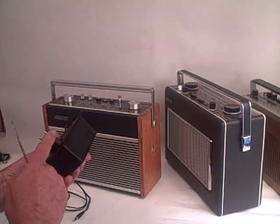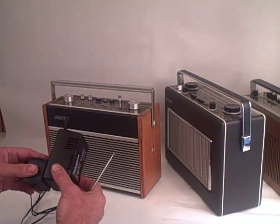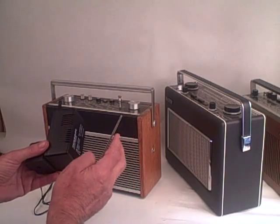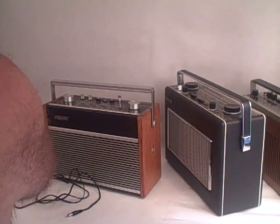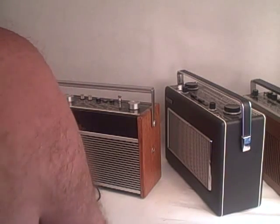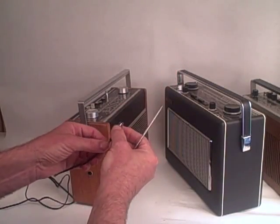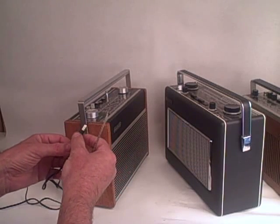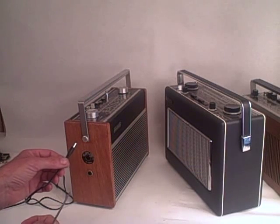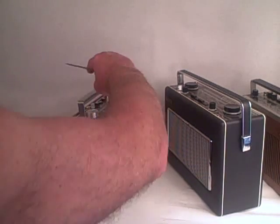It's got a two-pin Euro style plug integrated in, but with this adapter you can turn it into a UK style three-pin very easily, so it's suitable for use on the continent or in the UK. Plug it in here and put the 2.1 millimeter plug on the end, which is wired for negative center pin — what's suitable for most vintage radios. There are one or two that use a positive center pin, and I'm happy to supply it with a positive center pin plug for those that require it.